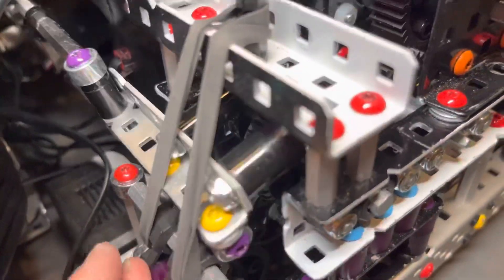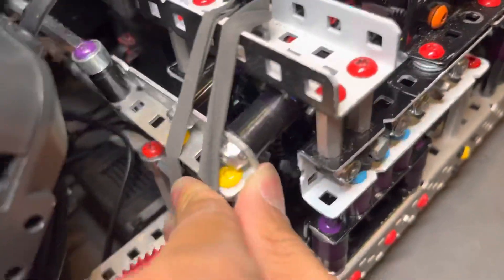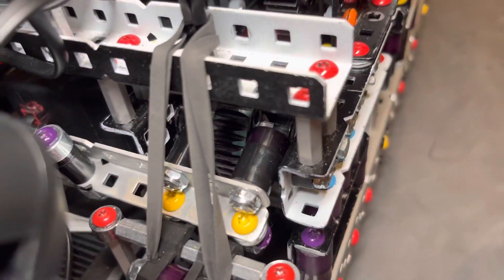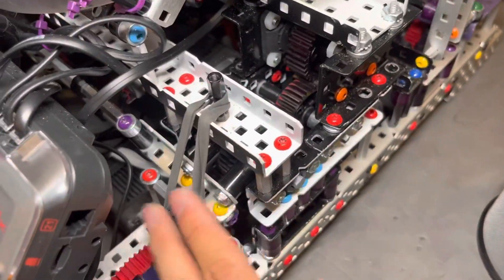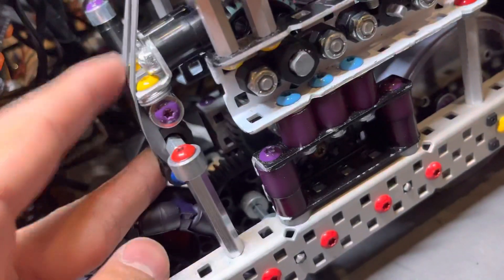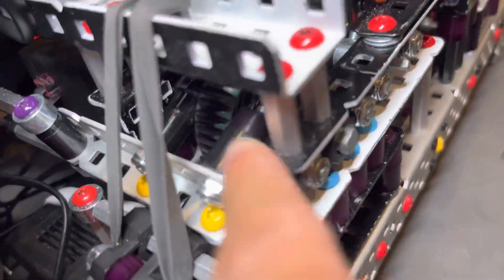We have a set of high-strength bearing flats sliding around on standoffs — it's pretty low friction, I'd recommend it. The only issue is that it's literally free-spinning, so the reason we use rubber bands here is to suppress this free spinning. If it shifts around, that's no good — we always want to engage the gear with these spacers. That's why we have these rubber bands to keep it nice and tight toward the gear. The way this linkage is made, it sort of locks out so the spacers contact the gear.